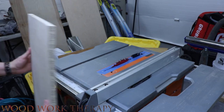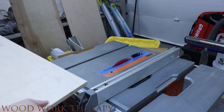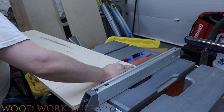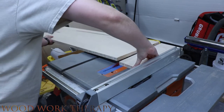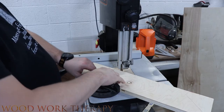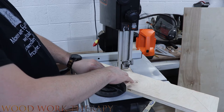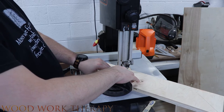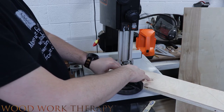Now we're going to take one of our cutoff pieces and create basically a bracket or supporting bar for the top and bottom. These are all pretty much the same — just cut them out nice and square. Then we take them over to the band saw, set it to a 45-degree angle, and use the miter gauge while watching the line already drawn on the piece. Since it's a triangle, we still have 45-degree angles to work with, which actually makes this part of the project pretty easy.